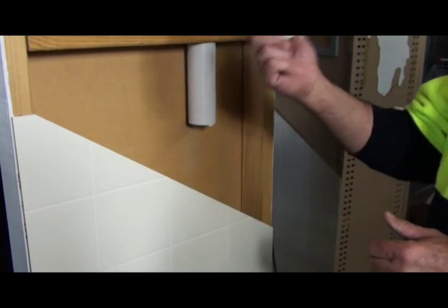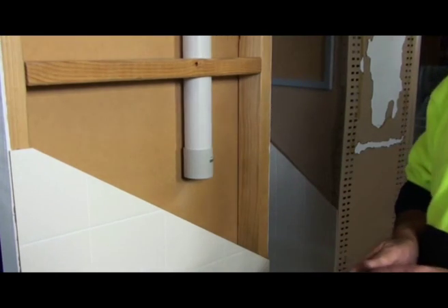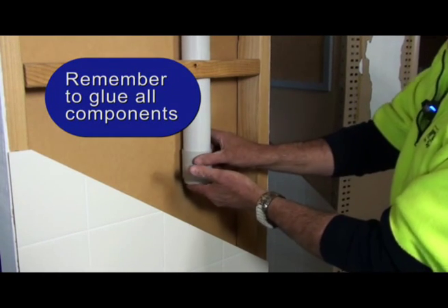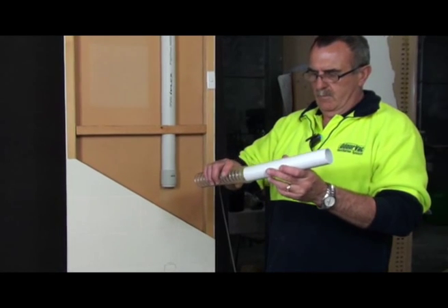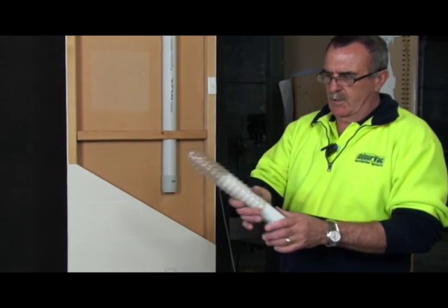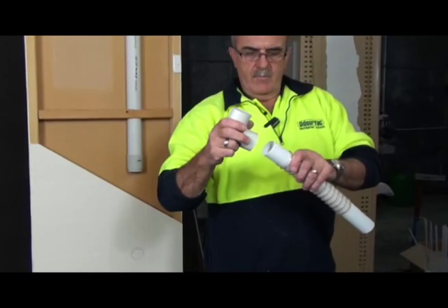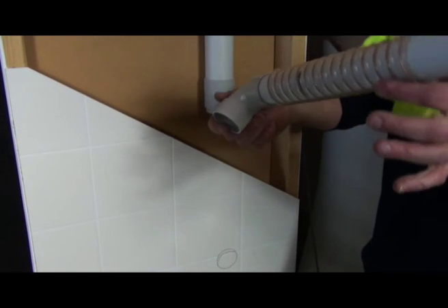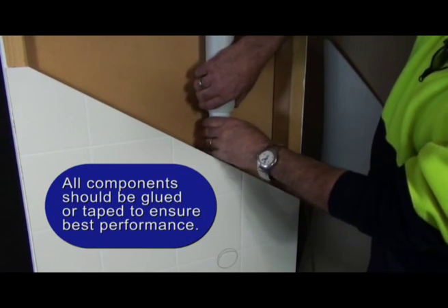Now that we've got the 50mm pipe in place, we need to position the 50mm socket, which needs to be glued. After putting the 50mm socket in place, we need to put a 40x50 flat reducer in place, which just sits inside the 50mm socket. After that, you have a piece of 40mm PVC pipe with 40mm flexible hosing, which you insert. It doesn't matter where you put it for the time being as that's for adjustment later on. Then a shorter piece of 40mm pipe, then a 40x90 degree bend, which is the rest of your WC connection in rough end stage. Once assembled, all you have to do is push it into the flat reducer.